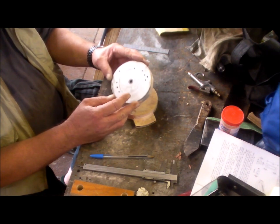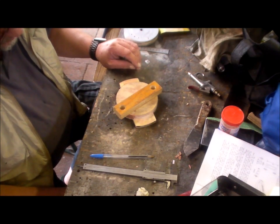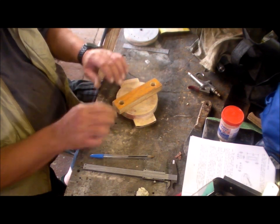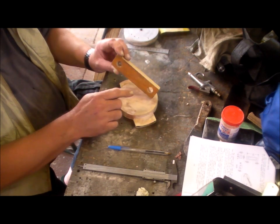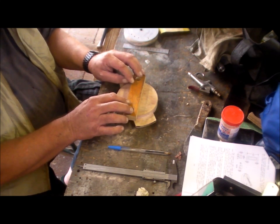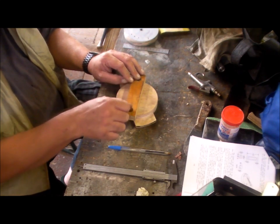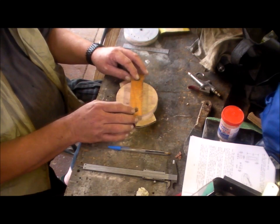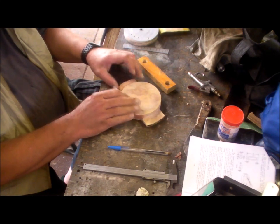So anyhow, that needs to be cleaned up, and then this is the block that the way will be bolted to. So that's got to have a 5/8 tunnel created in that, and he mentions drilling 2 5/8 holes, cutting that centre block out, and then mounting that on a board and filling that up with putty, scraping it out to create a tunnel that doesn't go all the way through, and it only goes about 5/8 deep. All right. But I'm still on the universal compound at the moment. See how we go.